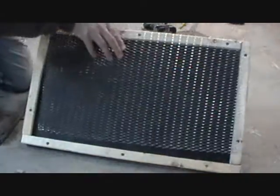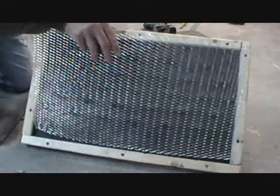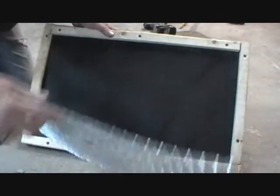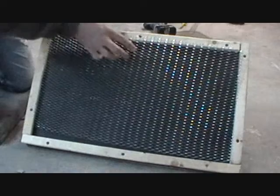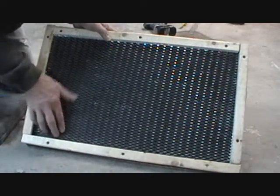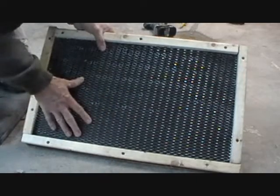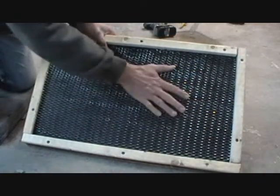Then you put your wire mesh on. See, this is the wire mesh, and this is dimpled. When you look down there, you see the dimples in there? Dimples stick in. It's a new thing. Not a new thing, but they want you to put that so it stays away a little bit and the cement gets behind it. Do I agree with it? Depends on the job. So that's it.